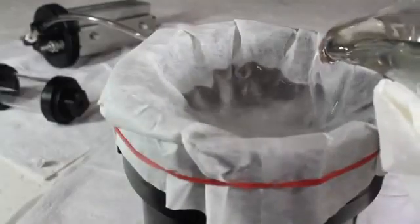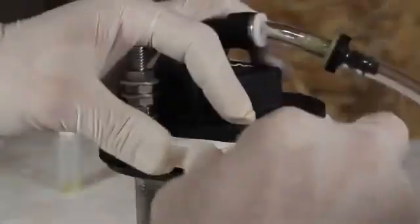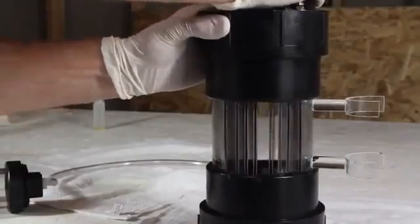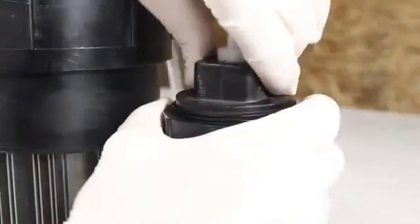So when they're stirred in, we can open the generator body and attach a coffee filter to filter the fluid into the super-cleaned casing. The filter is removed and thread tape is added to the cap, then the generator plates are slowly inserted into the solution and screwed in water tight. To finish up, we can remove the top cap from the bubbler, add some water, and screw it back together.